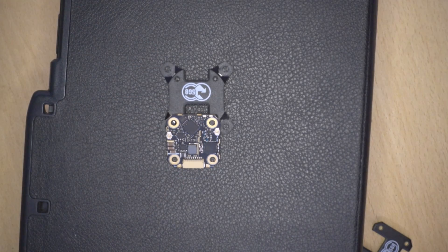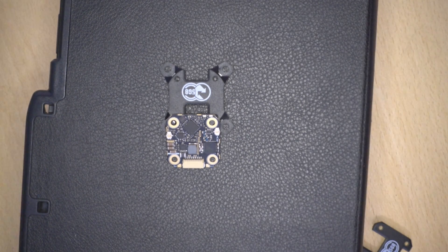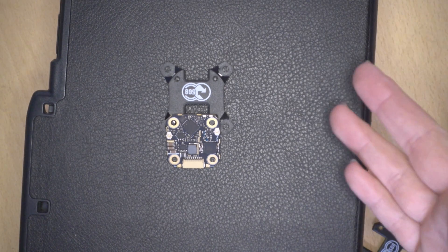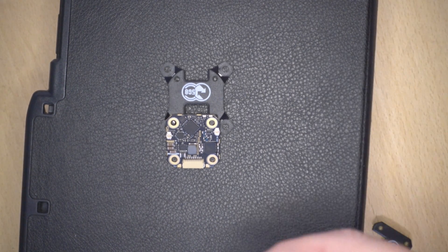Using a Unified Pro and Crossfire Nano in one unit, those two products work really well so there's no reason this shouldn't either. One concern when I first looked at it was that there was no Smart Audio support. TBS are moving toward a 'Crossfire bus' where everything goes over the Crossfire protocol — so you'd change VTX channels via Crossfire. The problem is if you don't have a Fusion VTX yet it won't work, and it won't work with iNav. Removing Smart Audio wasn't a great idea, but it seems TBS has listened.